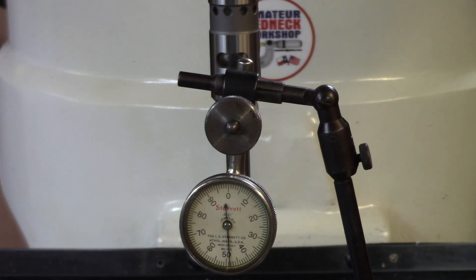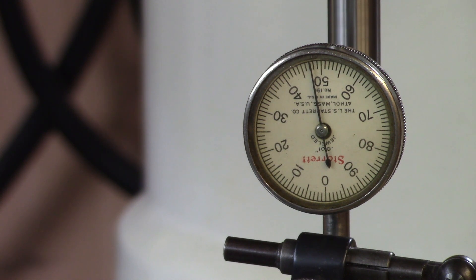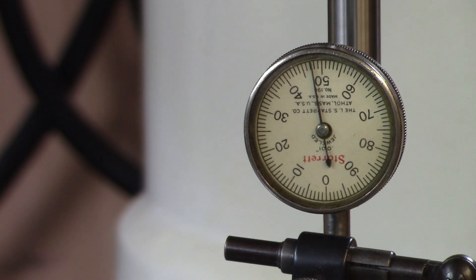So, 15 bucks well spent, huh? Plus five bucks for the two batteries that weren't included. I've got the conventional edge finder set up now — the indicator is ready to check it for runout too. That looks like a full 5 thousandths to me. Both of these guys came from the land across the ocean where everything's made, so maybe they had the same quality control guy.